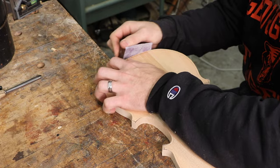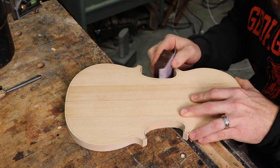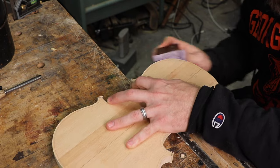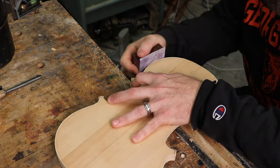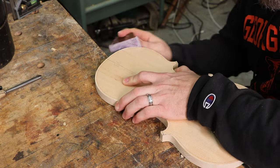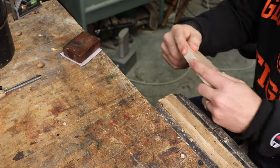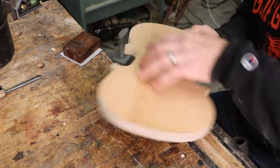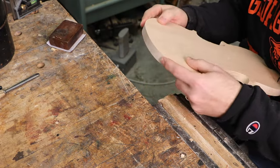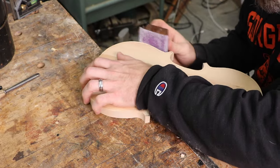I'm really trying to focus in on the smoothness of these transitions and curves. These curves and outer edges will serve as a reference when you cut the purfling into the top of the violin. I do a lot of this by hand with files and rasps and sandpaper, checking often with my hands more than my eyes to feel symmetry or any lumps or anything sticking out of the ordinary that would reflect later as a reference mark when we cut purfling or anything else.